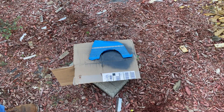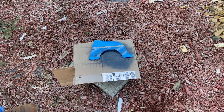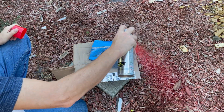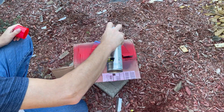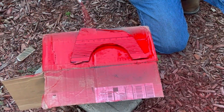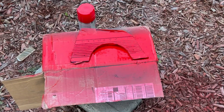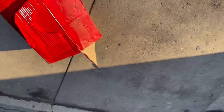I'm not priming this because I need to go over those letters with steel wool and take the red paint off. If I prime it, I'll get a layer of black under there that I don't want. I've done this many times with this paint and it's worked out well. I'm going to paint mostly straight up from the top. I'll let that dry and come back to do a couple more coats. That's a lot of red — about six coats. I've got most of the stuff cleaned up. Tomorrow, if the paint's thoroughly dry, we'll do the letters and polish the body.